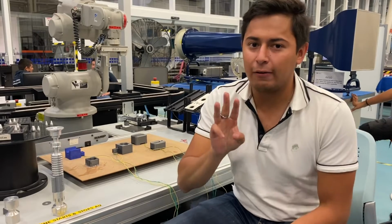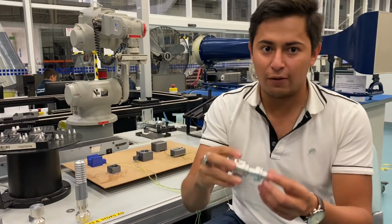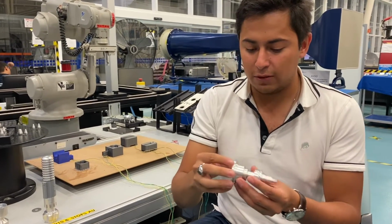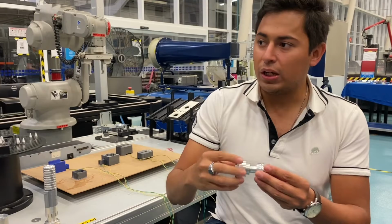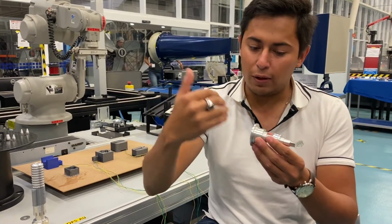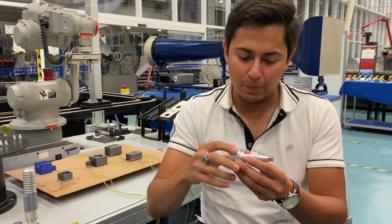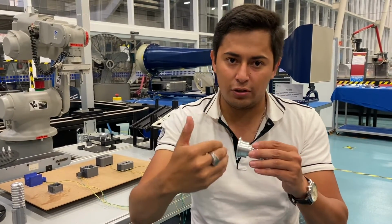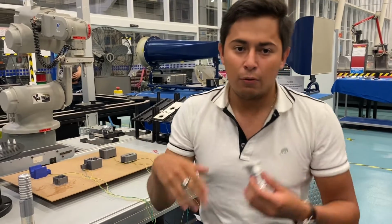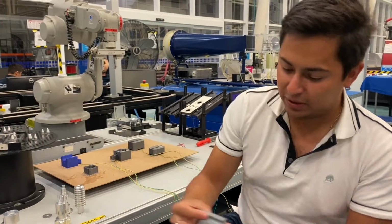So we have three main areas where we had problems manufacturing this lightsaber. First was the metal pieces that had to be manufactured. For example, we didn't take into consideration some holding pieces for the next procedures, so that was problem number one. Second, when we started programming some pieces, we weren't considering the position that the cutter was going to end. So when visualizing the program and how it was manufacturing each piece, we realized that there wasn't enough space for the cutter to go all the way through. So we had to cut it manually for some pieces, and for the next ones, we had already taken this into consideration. Then the second problem was the 3D manufacturing pieces.